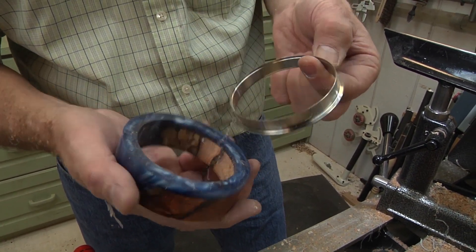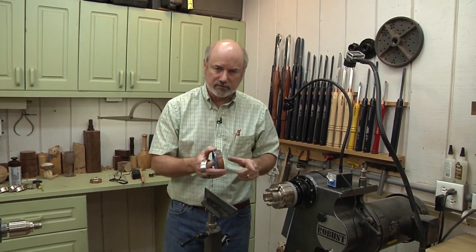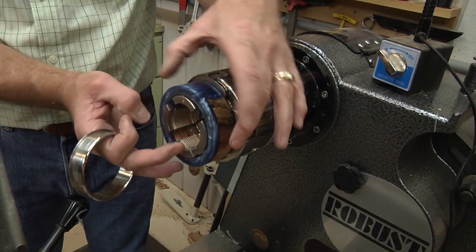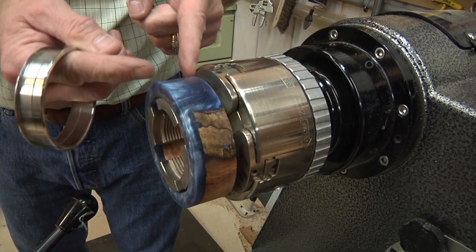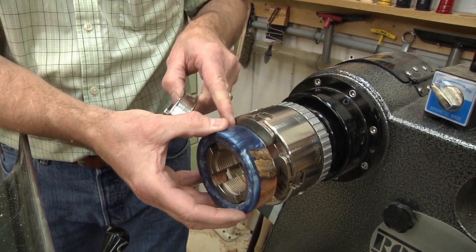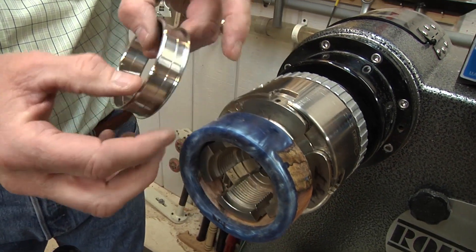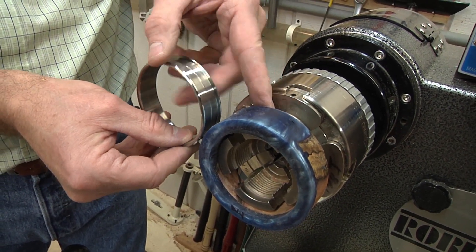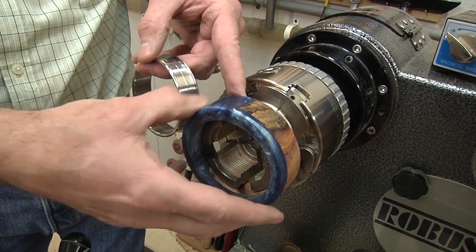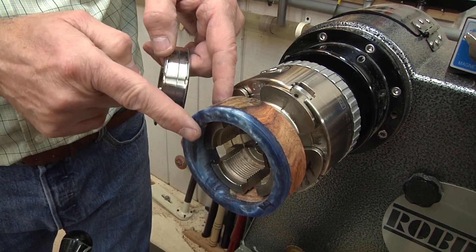We're going to go on to our next step. Now I've got a different set of jaws on here. These are long, thin, tapery jaws, but the whole idea is they're going to expand on the inside and hold this really tight. What I have to do is cut the width now, because you can see how wide the band is. I want this to be out away from the edge of the jaws because I've got to cut in this side to make this the right width. I also want to get rid of this band of plastic because I'd rather see solid wood and then run into the cool looking plastic. If I don't have this spaced out, I'll hit the jaws as I trim this.